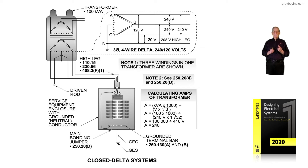Reviewing C to the connection to ground also gives 120 volts. But when we review B phase, that voltage goes through a 240 volt winding through 120 to ground, and on the other side we also go through 240 to 120. So if we took 120 plus 240 and divided it by the square root of 3 — 1.732 — we would come up with 208 volts, and of course that represents the high leg voltage.